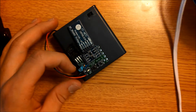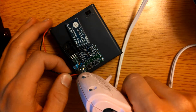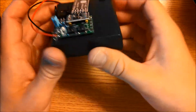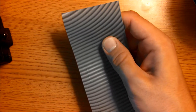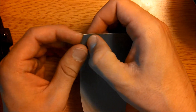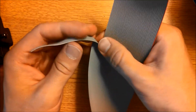Reinforce the power connections here by adding some hot glue too. Let this cool and set it aside. Then grab your 50-conductor cable and take off a section of 8 wires, ripping off around a 4-foot section.